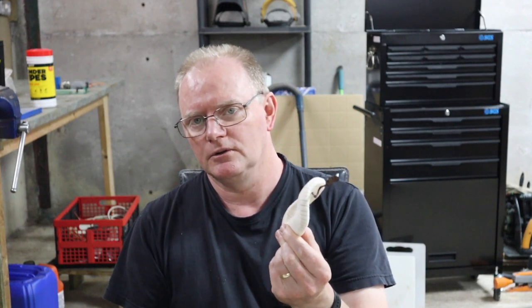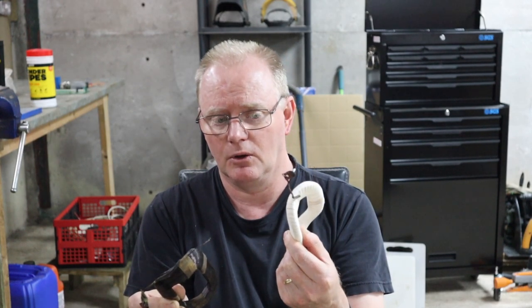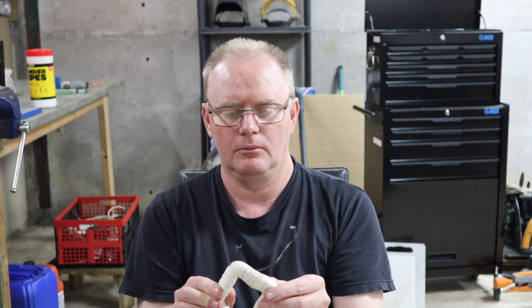And in fact, I have done one of them, as you can see. Now, this is not quite finished, it's just been wrapped. In today's video, I'm basically going to wrap this one so you can see how I do it and what I've learned. When they've both been wrapped, they then need to be varnished. There's a special varnish that you need to put on, which makes this fabric more permanent. It protects it, and it also gives it a certain amount of heat protection. You have to use a particular varnish because it needs to be essentially non-conductive.